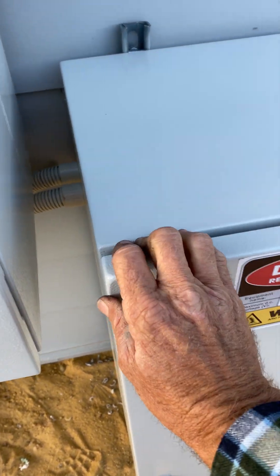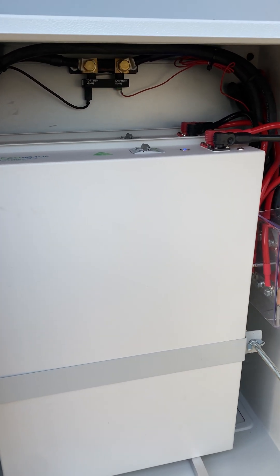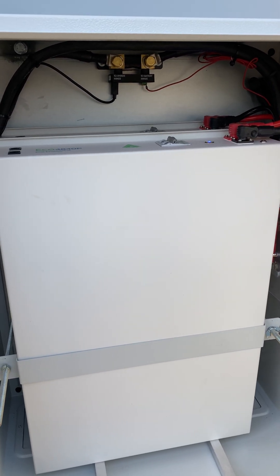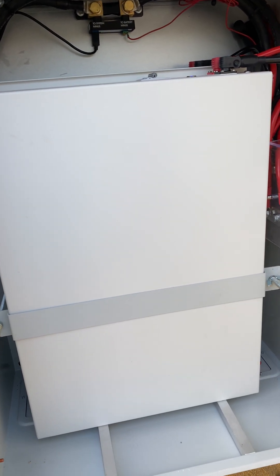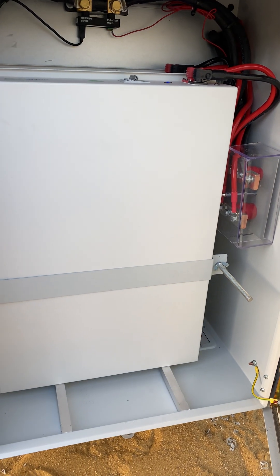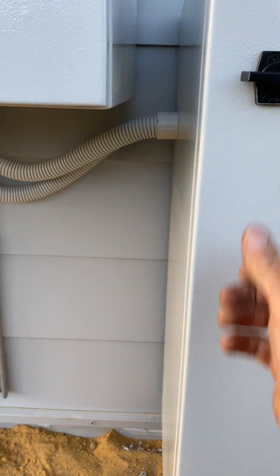I've used Power Plus Energy batteries — there's only two, which is a bit small for this house, but they're pretty confident that's about all they're going to need. They're going to live pretty conservatively and a lot of stuff is gas. We've got a shunt in there just for accurate measurement of the battery state of charge. I can actually fit another two batteries in there — it doesn't look like it but I've got a space between the two. It's a beautiful little cabinet — this comes pre-wired and everything from Power Plus.